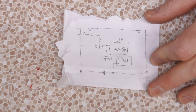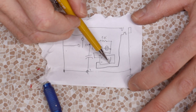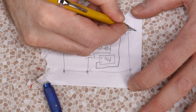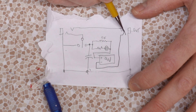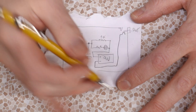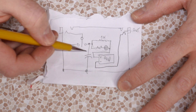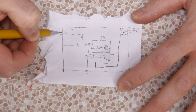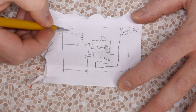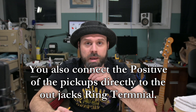So what is this schematic? It is the schematic for a power supply, minus the disconnect. You're going to do the thing that they do in EMG pickups normally — that's going to be the out jack. You plug into there, the sleeve and the ring short out to connect the 9 volt battery to the ground bus. We have our 9 volt battery, a resistor-LED network, a capacitor, a mode switch, and the input where the ring terminal is going to supply positive power to the instrument. You're going to have to use a stereo TRS type cable to do this.